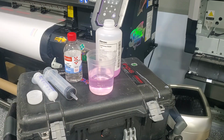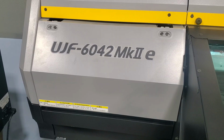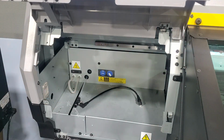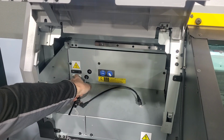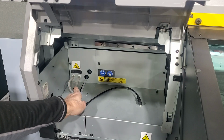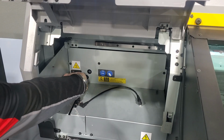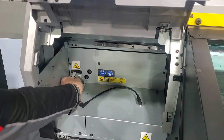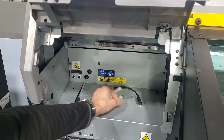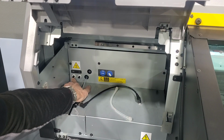We're now going to inject this into the machine using one of the 2 syringes. Our coolant system access is behind these clamshell doors on the left side. This is active while the machine is running, pumping fluid through it. Only time it's not is when we're, as I spoke of earlier, in the windows that will allow us to fill this up. So now we can undo this. This is where we put the water in. This is where we suck air out to purge the system.